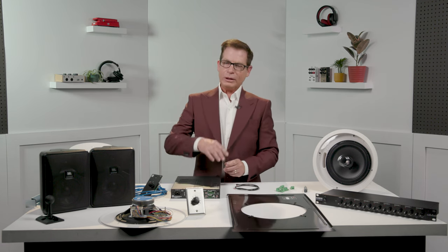In the case of the JBL system here, they've simplified this a bit — it's a newer version of the volume control that utilizes an RJ45. The RJ45 connects here, goes into a port on the back, and fits a single-gang wall plate, doing the same thing in a more advanced way. We can have one volume control drive two loudspeakers by daisy chaining — from the amplifier to the volume control, out to the first speaker, then daisy chained to the second. When we adjust the control, both speakers go up and down in unison. We can also mix different speaker types — nicer ones in the main space, a lower-cost one in the restroom — without worrying about impedance matching as we would in a standard PA. Regarding the ElectroVoice system with its large back can, the bass is extended, though all 70 volt systems do have some reduced bass response and insertion loss from the transformer — 90 percent of the time it's not an issue, but worth being aware of.